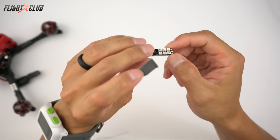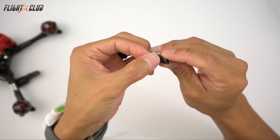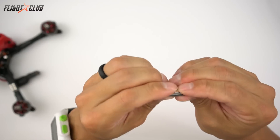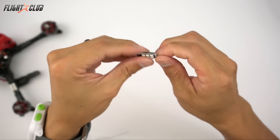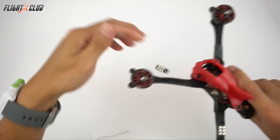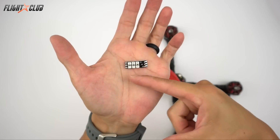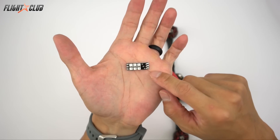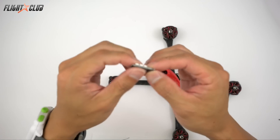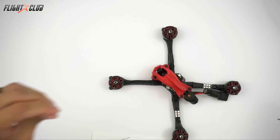The next thing we're going to do is just take a little piece of double-sided tape and put it on the back of the race wire. This is very important because the back of the race wire is conductive and you need to keep it off the carbon. Then you're just going to place the LED on the arm, but make sure the LED is a little offset - you see there's more space over here - put the LEDs closer to the motor so they're less likely to get chopped up by the props.